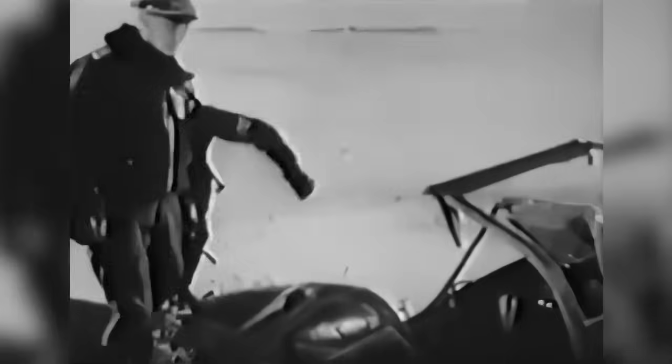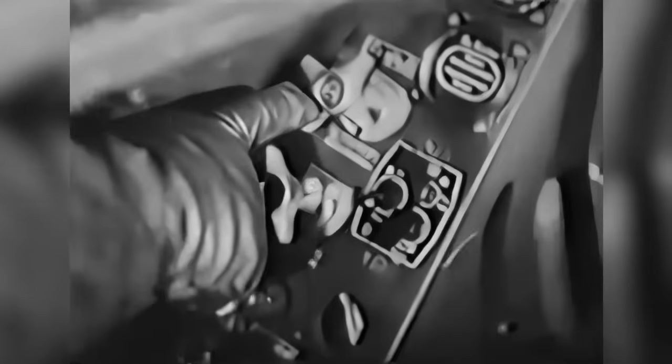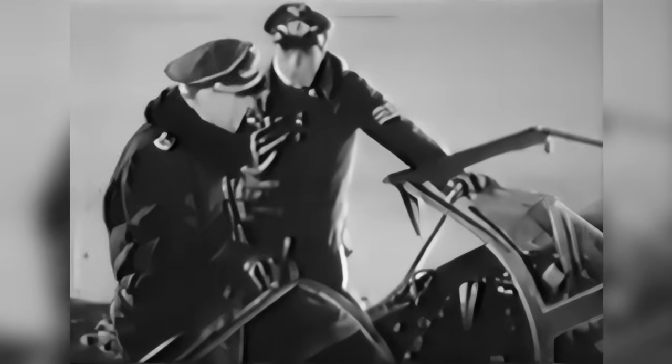The four cannons, marked 108-30mm, are adjusted at 800 meters. After basic flight training, the students will practice firing on ground targets. These two knobs are used when the undercarriage fails to come out — the oil cylinders are under great pressure, so when the knobs are opened, the oil pressure is released and the undercarriage will come down by itself. This happens frequently.